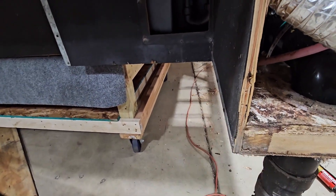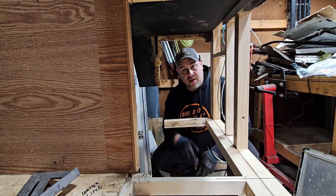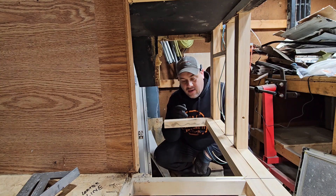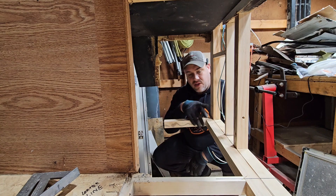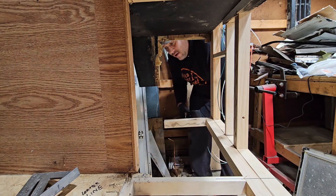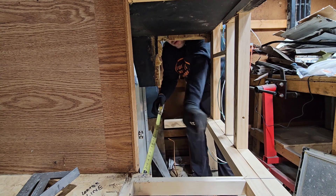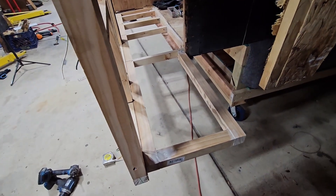I'll measure this board to get the measurement from here to the main floor, then put a couple more trusses in. On the other side I took a measurement from the outside in — it's basically seven-eighths of an inch. I cut off the excess, measured this part of the board on the other side which was nine and five-eighths. I put a square right here and it's a nice 90 degrees. I measured from the outside of here to the inside of this board, which was 22 and an eighth, so I'll cut a piece for that and probably do two spines or trusses inside.